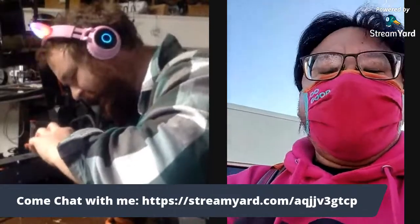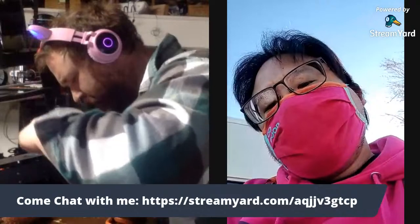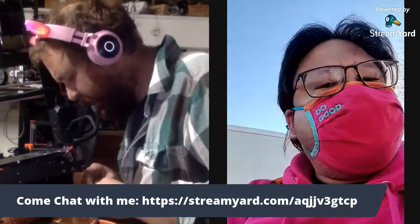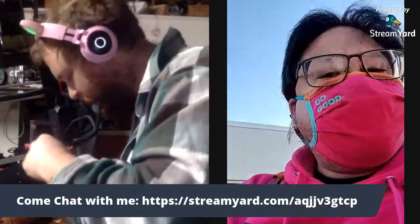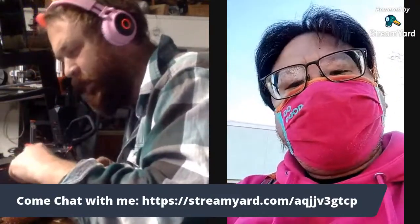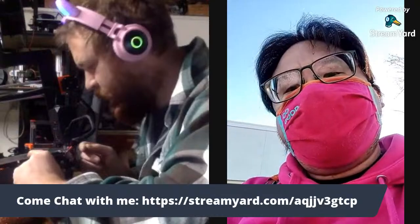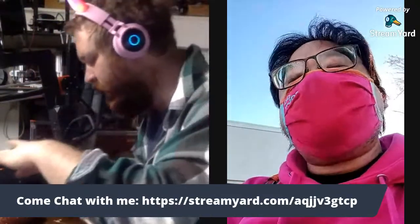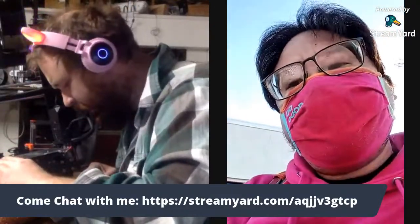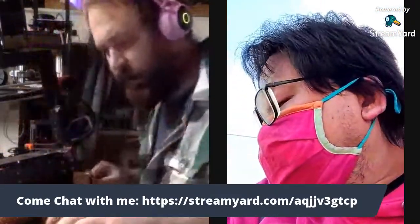Can that be completely replaced? Well, the entire board can be replaced, but I don't know that I can replace the pad. I can solder the pad a little bit, but the trace is inside of this guy. It's a metal plate, and then they put like toaster wire back and forth to work as heating elements. And then over that, it seems like there's some sort of epoxy mask. And so at some level, I could potentially scrape the solder mask, the epoxy mask, off.